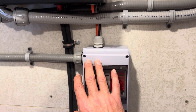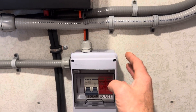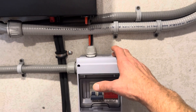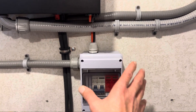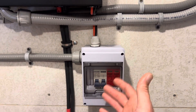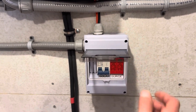These HT 5-way DIN rail boxes have improved a lot over the last couple of years. The first one I bought had threads that would strip out if you barely torqued the screws. They've since reinforced the plastic on the base plate and cover so you can actually get some torque on the screws — the cover sits nice with a seal. These are rated for outdoors, but I personally wouldn't use them outdoors. They make great little boxes for indoors though.